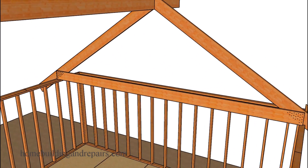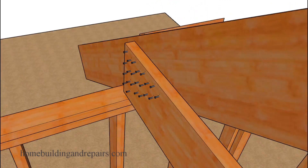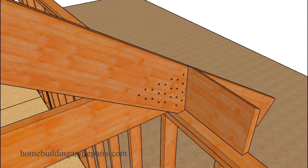You can install the nails on both sides if you need to, and you can use larger lumber if you need to. If you need to put 51 nails into a roof rafter and a rafter tie or ceiling joist, you're probably going to need 2x12s for both of them.